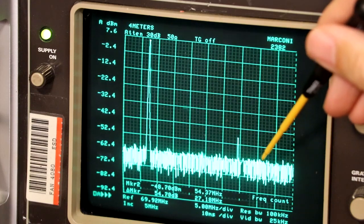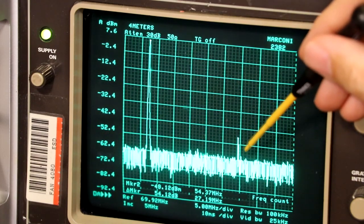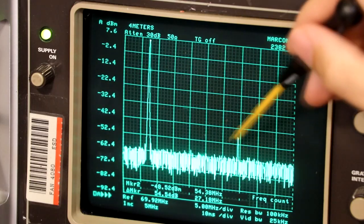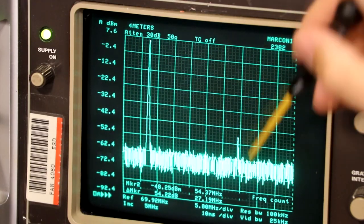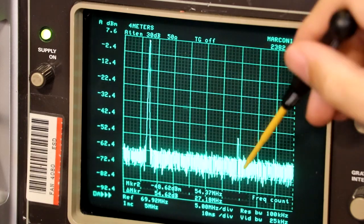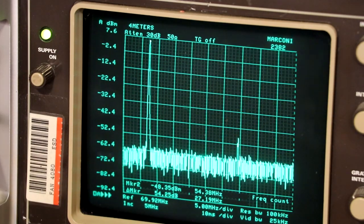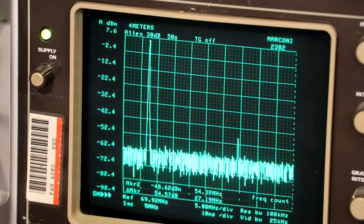And I think the reason they do that is this peak will show up on a power meter, because it is power being transmitted, but your radio is being tuned over here somewhere to 27 megs. So although that power will show up on a power meter, it does nothing useful. If you go to one of these places that tweaks up your radio to maximum power, you'll see that second harmonic there, and you'll think, oh wow, my radio's doing more power, but half the power is coming out in the second harmonic, or in fact the third harmonic, which will be down here somewhere off screen.